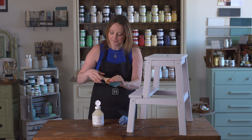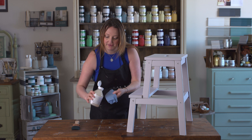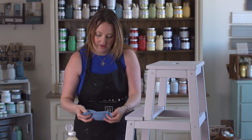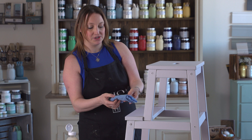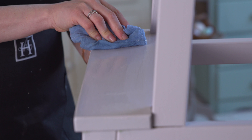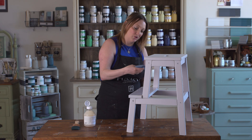I've got a damp rag here and what I'm going to do is soak the matte Tough Coat into the rag, and then really simply just wipe it on. I'm going to start from one end and go across all the way to the other in one consistent long stroke. You don't want to go back and forth on it because you will create texture — as it starts to dry you'll pull back and create a bit of texture — so we don't want to do that.